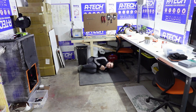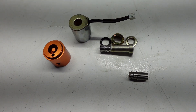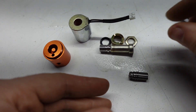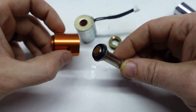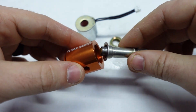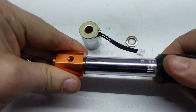And we're only just getting started — you still have to assemble it. We need to bring back all of the parts we set aside before, along with the solenoid body and the solenoid we just finished. I also need a custom tool just to put this thing together — it's a socket that has notches filed in because there is no other way to access this screw. I put the plunger in the operator, put the O-ring over the operator, line everything up and press the O-ring into place, making sure everything is still properly aligned. I then take this piece, slide it over the operator, put it back in, and tighten it down by hand and then with the tool.